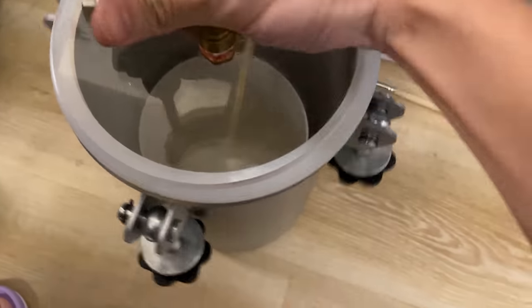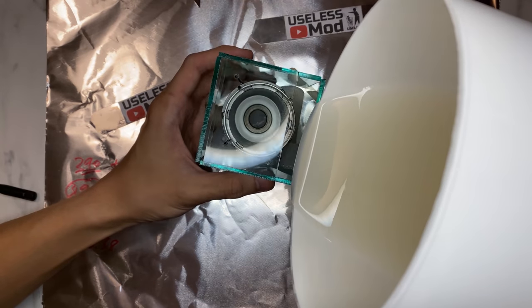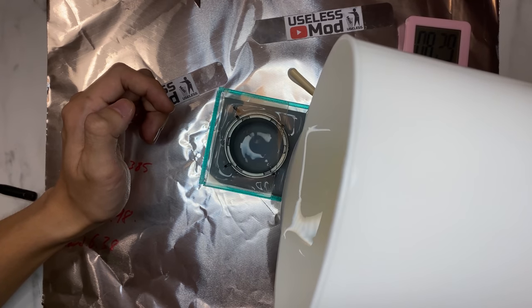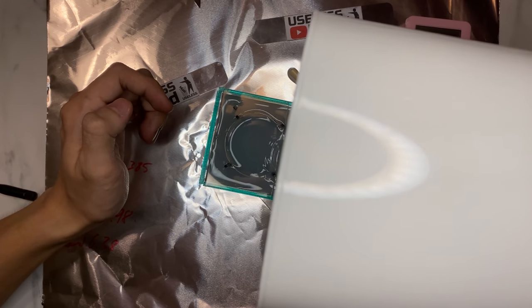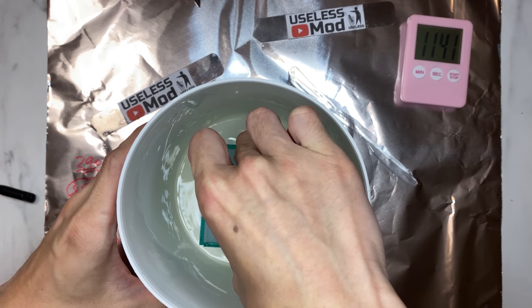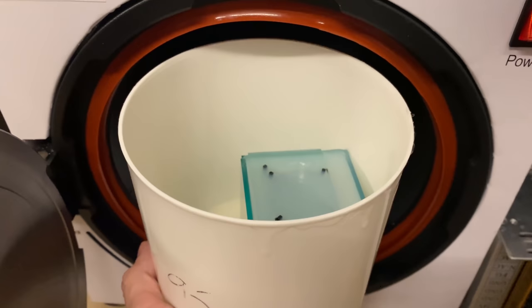After mixing, put the silicone into the vacuum chamber to degas it. You can see a lot of gas bubbles coming out — degassing is a very crucial part of making a silicone mold. Now start the silicone pouring. Remember to pour slowly and tilt the mold at an angle to eliminate gas bubbles. I put the mold together with the leftover into the oven to cure so it can be cleaned up more easily.